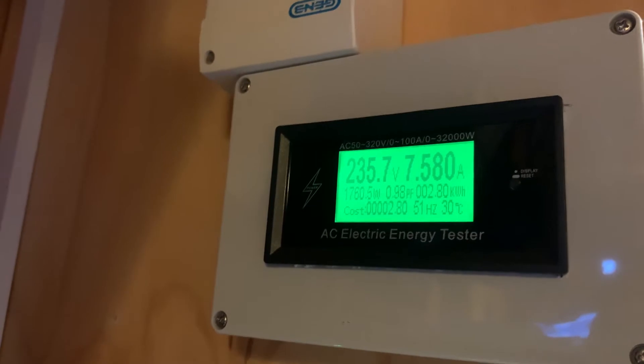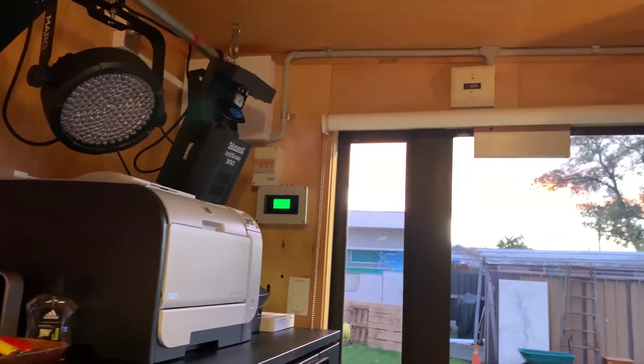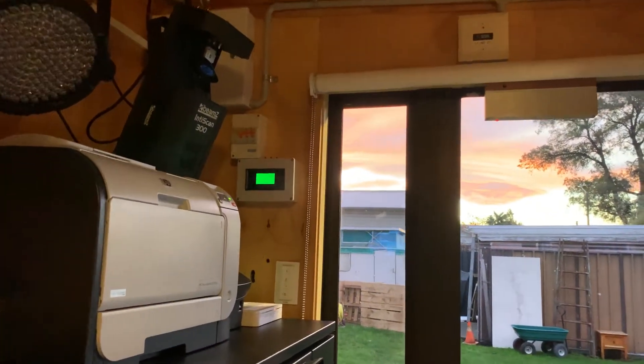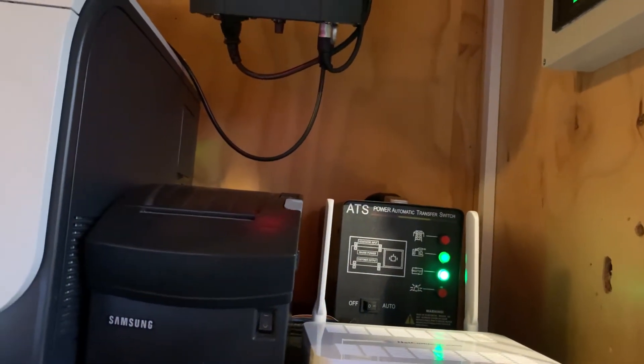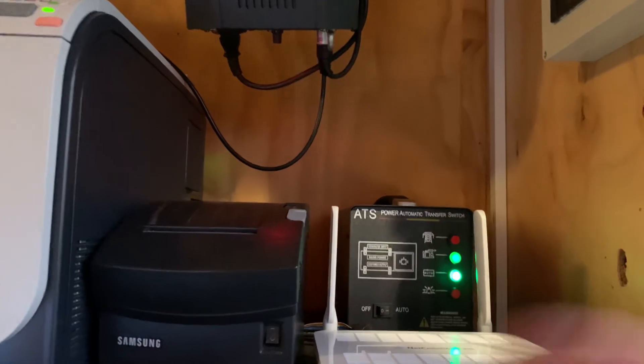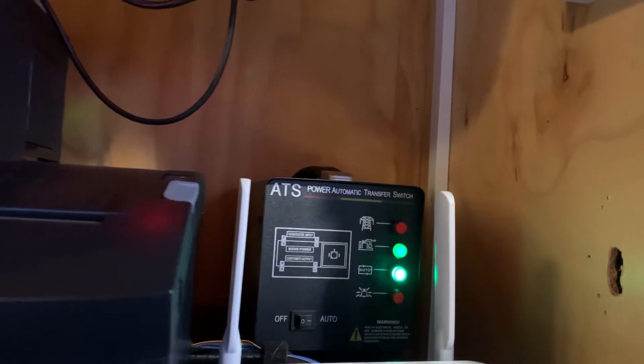I'd really like it if it ran at 50 Hz because of all the sensitive equipment in this room. The generator is AVR regulated — it's not an inverter generator, but it does the trick. In the future I want to make my own automatic transfer switch interface with features like a timed maintenance period, so once a week the generator turns on by itself and switches over the load — meaning nothing loses power because the generator is already running before the contactor activates.